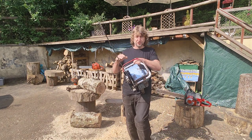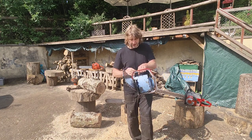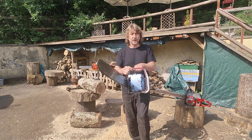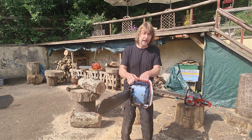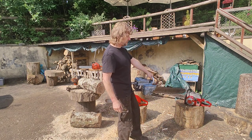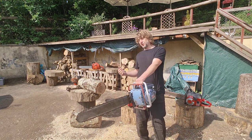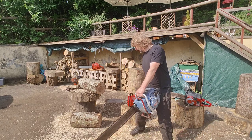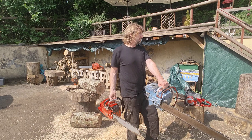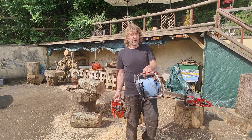So the development for this girl started in 1962. Well, it started before that, but they launched this saw in '62, and the powerhead only comes in at just over 8 kilos. And then some 10 years later, the same displacement engine from Jonsereds comes in at just over 7 kilos. And then a further approximate 10 years later, you have this footprint which shaves another kilo off it. So each decade or so, off some of these designs, they were shaving 2 pounds in weight.